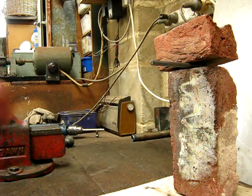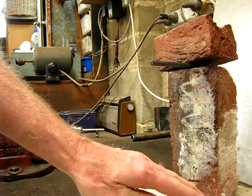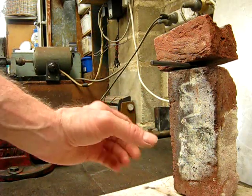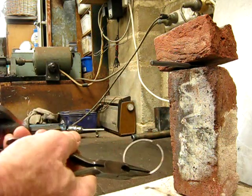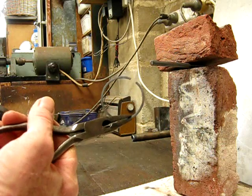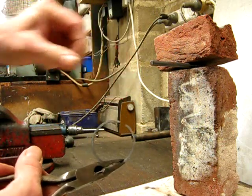So you can see how I did that. I worked my way around it gradually, made sure it all got red hot, and eventually it will just drop off under its own weight. Now here's the ring - you can see it's holding that amount of set. Previously those faces were parallel, probably a millimeter apart.